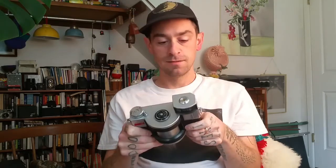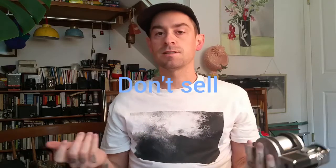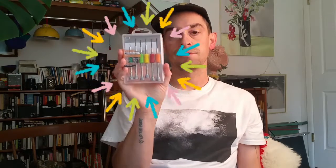What I wanted to talk about is: when you buy used cameras on the internet, whether it's a point-and-shoot or anything, I would highly consider — as the buyer, or as a camera seller — investing in something like a JIS set of screwdrivers. You can get them on the internet for not very much. There's Phillips head and flathead, and they're meant for Japanese instruments. They work for many different kinds of screws and they're not so blunt — they go deeper into the pit of the screw, so they have a tendency not to slip or strip things. They're really precise and well made.